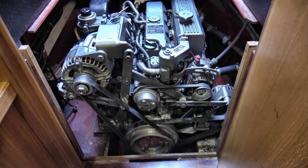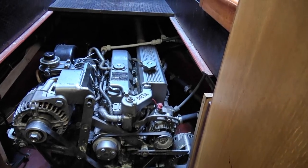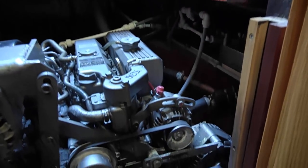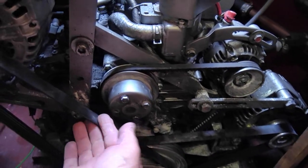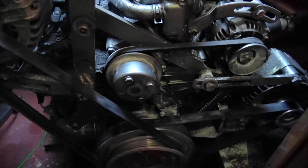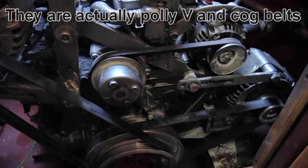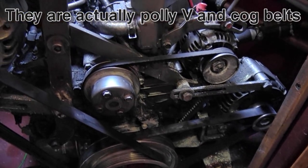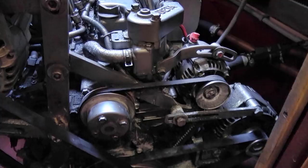We've took the front section off and you've got access to a lot of things. You may also notice - this is just a tip - we've got talcum powder around here. You put that on your fan belts to stop them slipping at any time. You just do it on and then every now and then give that a tidy up. That's what you see - just talcum powder basically.